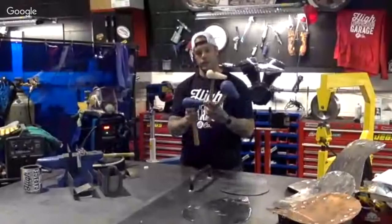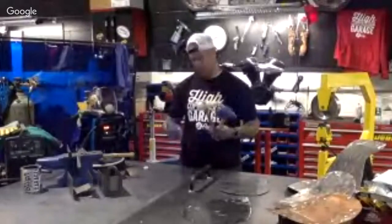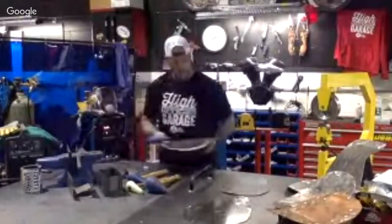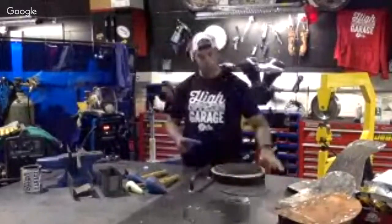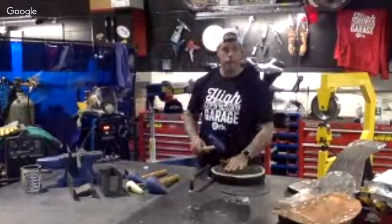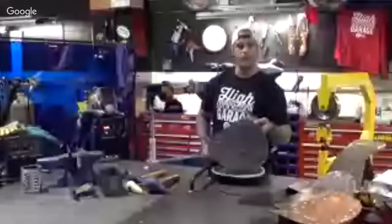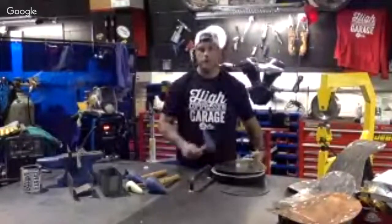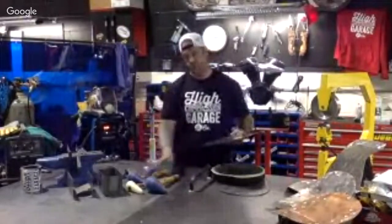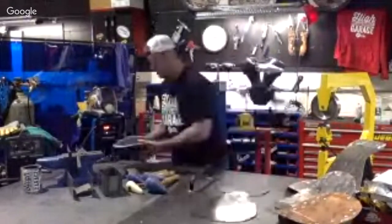We have this end, which is going to put a small scar into the metal. This one more of a larger scar into the metal, and striking it through. We're using these. We've got a sandbag right here. You can use BBs in these as well, and you can also pick these up at probably your local store. But all we're doing with the metal on these, for instance, I got a C-pen right here. We're taking these through and hammering it all the way through to get us a radius. That's the purpose of these teardrop mallets, is to just continue to strike away and form that metal for us.